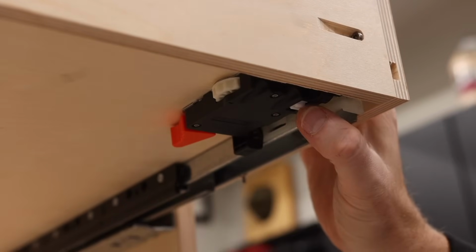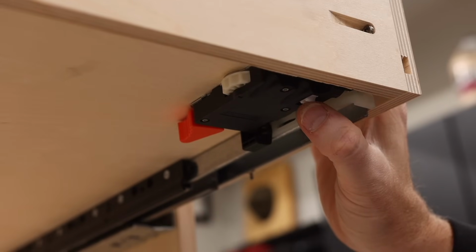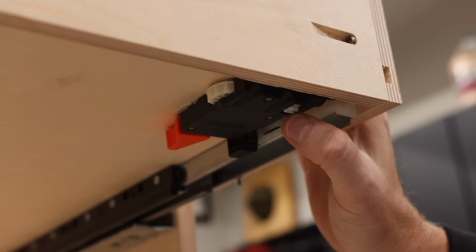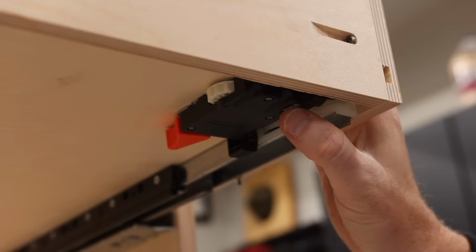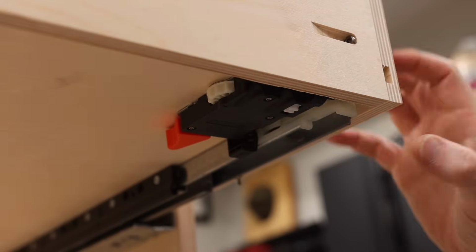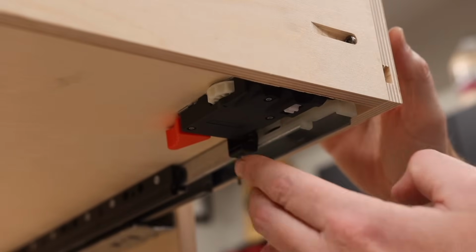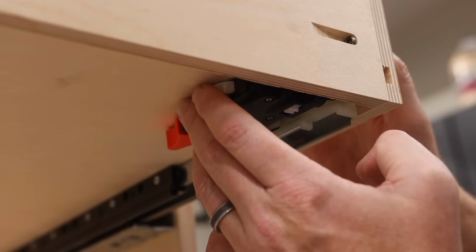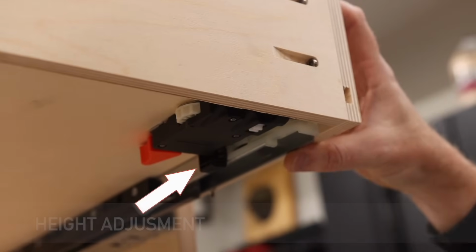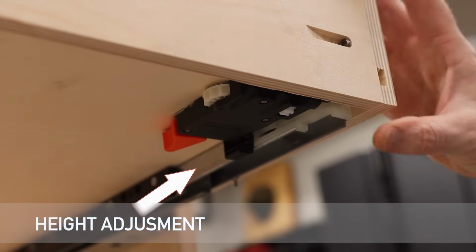And then we do have some adjustability built into these clips. You'll notice that with this particular clip, we have some adjustability here, and we have an adjustability wheel here. Basically, what these are going to do on both sides is allow you to move the drawer box left and right. So after you put your drawer fronts on, if you need to work on your reveals a little bit, you have some adjustability there. But we also have the adjustability on this wheel to make the cabinet drawer go in or out, right? So we do have some movement forward and backwards as well with these clips.